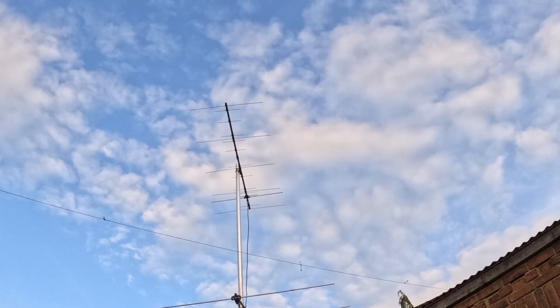The next thing to do was to test it right at the top of its range. I decided to have a go on the 23cm band — 1296 MHz. I haven't got a 1296 MHz antenna, but I decided to wait until there was an activity night on. I've got a dual-band Yagi for 2m and 70cm, and the third harmonic of 70cm is roughly 1296 MHz. So I thought I should be able to pick up something on 23cm. And I did pick up a signal on 23cm — I was quite impressed. It received a signal on SSB on 23cm. It wasn't overly strong, but it proves that the dongle actually works up there.